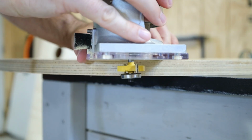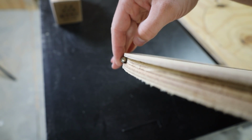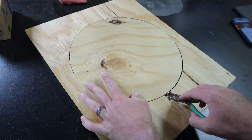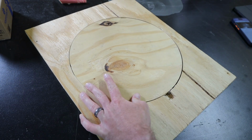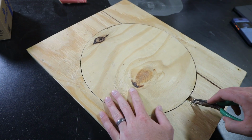Hear me out. If I make a groove on the edge of the spinning platform, and a matching groove on the edge of the outer board, and lock them together with the 3/8 inch bearing balls, I can scrap the 3D printed bearing altogether. I'll still need to print the gear so I can actually spin the platform, but that shouldn't be a problem.